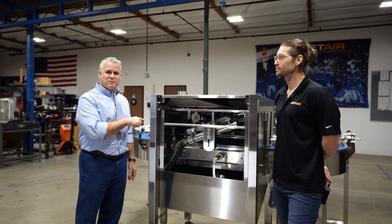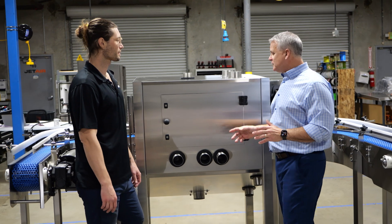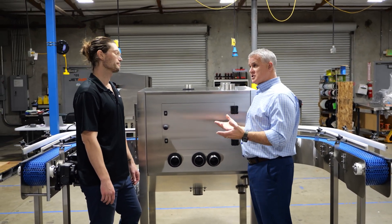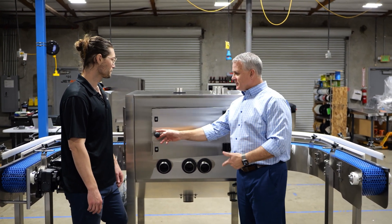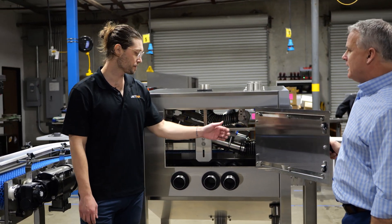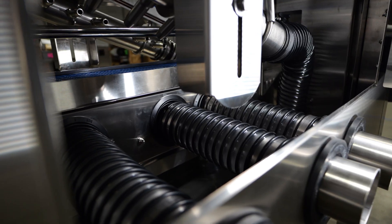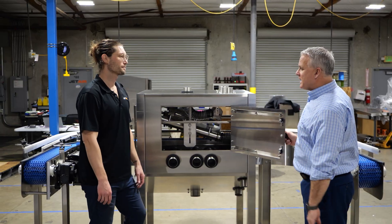So let's take a look at the other side of the machine. Here at the back of the machine I notice two things: first, there's no observation window, which is typically there with a JetAir product, and then I notice these three ports. We don't have a vision window to meet the Class 2 Division 2 specification. And these are just all of our inlets for the under-conveyor or bottom drying — there's three air knives going underneath, along with that ionizing bar.